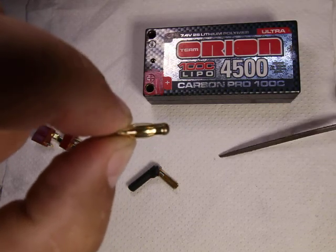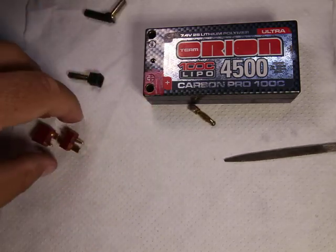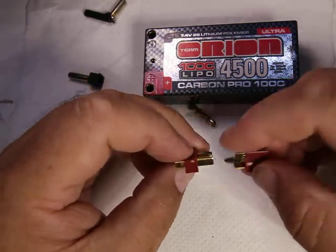To summarize the fix: take the outer sleeve, slide it all the way down, use needle-nose pliers since it gets hot, and put a little bit of solder all the way around the very tip. It works great — never loosens up, makes great contact.